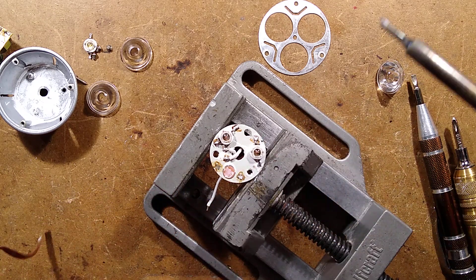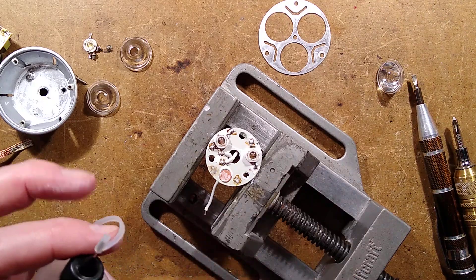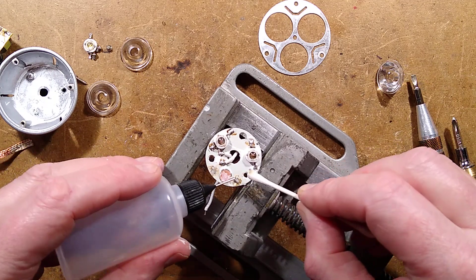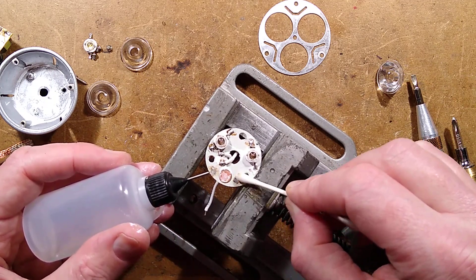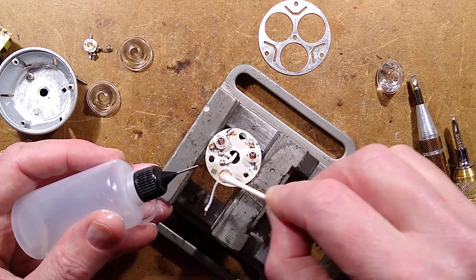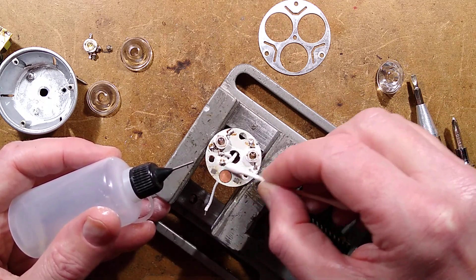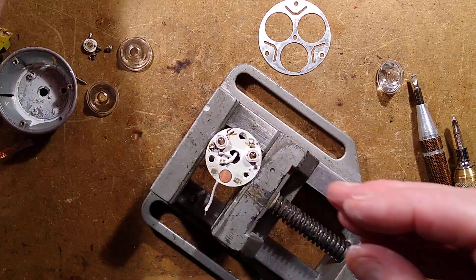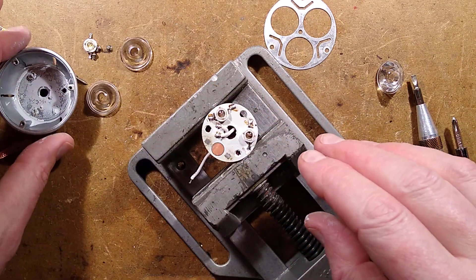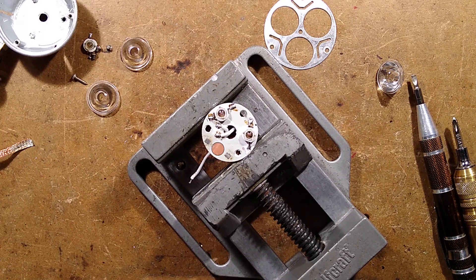Polarity-wise I should mark this. Let me get some isopropanol and clean that as well — it's a bit grubby. Here's a cotton bud and some isopropanol which dissolves flux. I'll just give this a quick smoosh around. It's not cleaning very well — cruddy old flux from previous manufacturing perhaps. The heat sink compound, which tends to be a silicon-oil base with zinc oxide, has crept everywhere. That is bizarre — why has it done that? There will be a scientific reason for that.